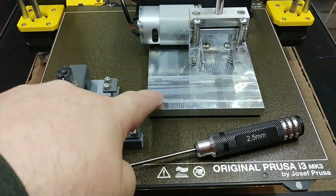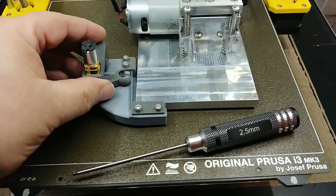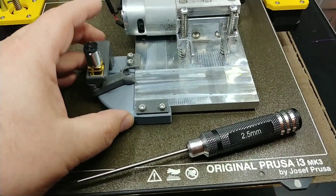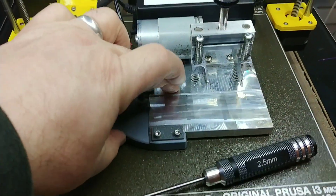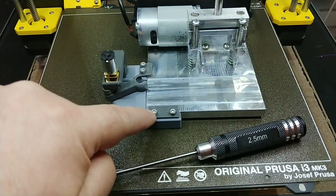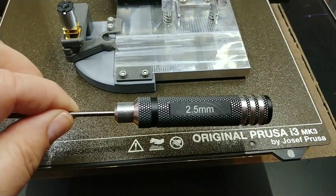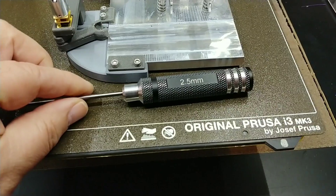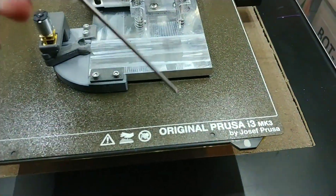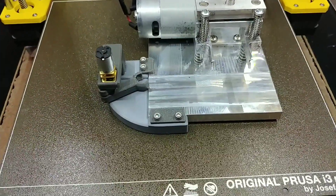Once you've moved the foot from this corner further in to the base plate, you can put your reciprocating machine over the front edge. Make sure you're pressing it in towards the tire truing machine while you secure all four clamping screws with your 2.5 millimeter hex driver. Make sure you only go finger tight or hand tight — don't over-tighten these screws or you will strip the plastic.